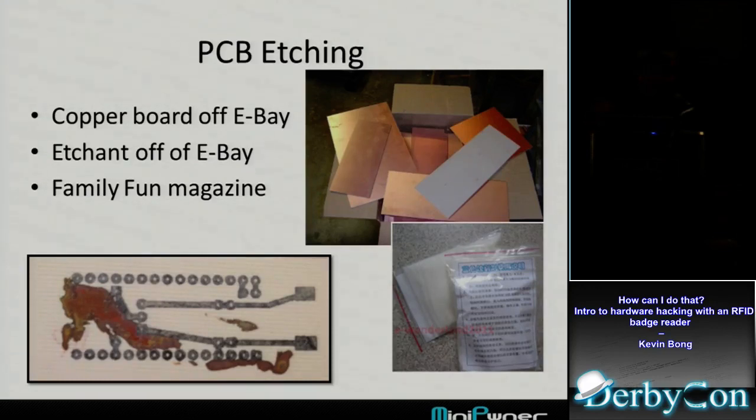After trying a lot of things, I went to a stack of Family Fun magazines in our laundry room that no one's touched in like 3 years, pulled one off, and it was perfect. It worked great. I figured out you had to use heavy toner and actually tell the printer it was using thick paper, so it would heat up the toner a lot and a lot of it would stick. And I showed my wife, and she's like, "You used my Family Fun magazine?"